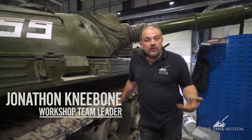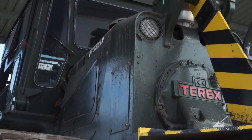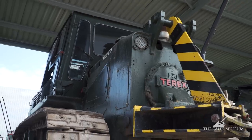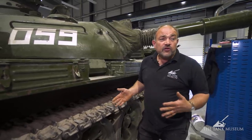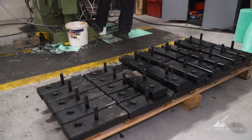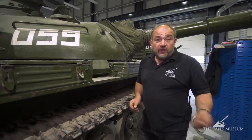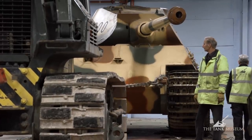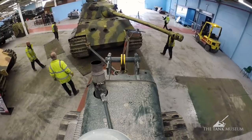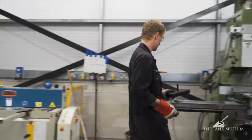If you look at the track on this Type 59, you see there are no rubber pads on it. Rubber pads are usually fitted to make the track less aggressive, and they're fitted to most modern tanks so they can drive on roads — and also to our Terex. The pads on the Terex were worn down and had to be replaced with modified Chieftain pads. This was done some years ago using an outside agency, but because of the new facility and Bob Kendall and Jacob, we've managed to modify those pads completely in-house, saving the museum quite a few pounds. We want to get them on now because of the big move — we don't want to scratch the floor. The Terex is nice and small, can pull heavy things, and means we don't have to use the Centurion ARV or Challenger recovery in tight spaces.